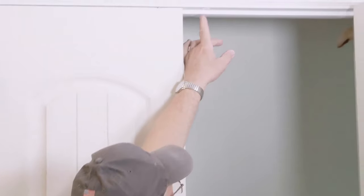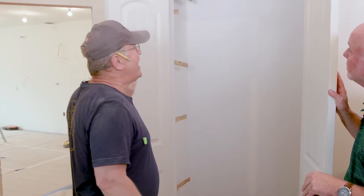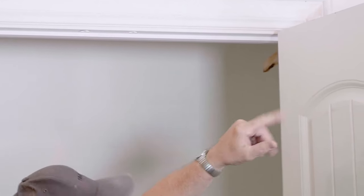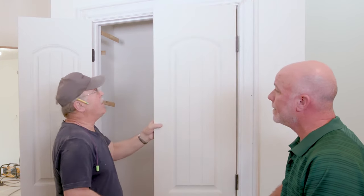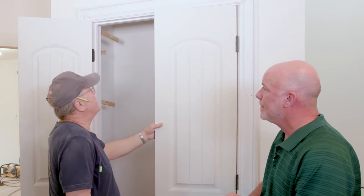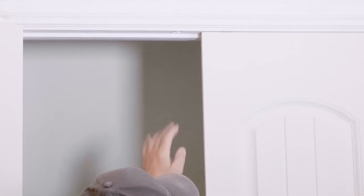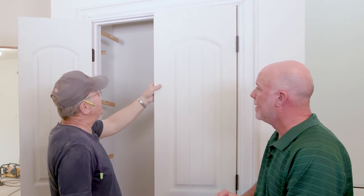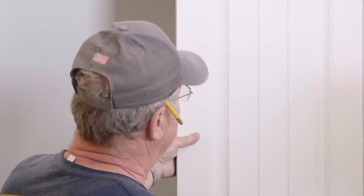The new magnets are drilled in flush into the jamb, with one on the door as well. The old ball catches had a strike plate with a spring-loaded ball on top of the door that would compress when you closed it and pop back up to hold the door — the door always had a wiggle and a wobble. With these new magnets, you just get the door close and it closes by itself. We put little bumpers in after painting to stop any banging noise. These are so much nicer than ball or roller catches — a great improvement to double doors.